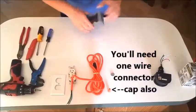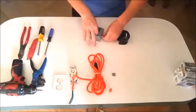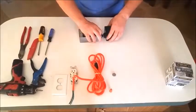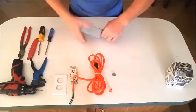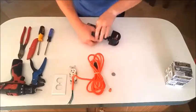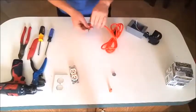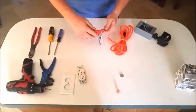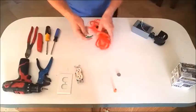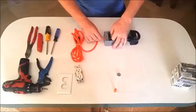Let's go ahead and get started. First things first, I'm going to take my motion sensor and just fish it through the hole — we just want it finger tight, as they are made of plastic. If the cord was already connected, just take a box cutter and cut the outer housing, being careful not to damage the electrical lines. Then we're going to do the same thing on the receiving end and fish our line through.